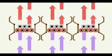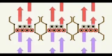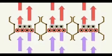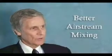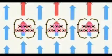The first row of coils can be operated under maximum pressure, removing the possibility that the volume of steam may drop to damaging levels. In water systems, the first row ensures the second won't freeze, without the expense of high levels of glycol. Dampers stay open longer, such that the two air streams that are mixing are more equal in size and temperature. In the original design, when you get very close to the set point, the face damper is almost closed, so you have only a thin stream of hot air mixing with a much larger stream of unheated air. With the MV coil, the two air streams are more equal in size and temperature and, as a result, are easy to control. The new damper position also helps eliminate laminar flow that might occur using only the dampers for control at very low air flows.